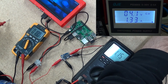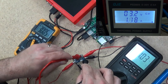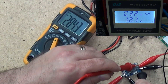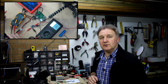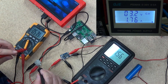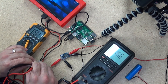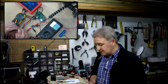I'll drop the voltage to 3.2 volts on the lab supply and have a look at the input. The input is fluctuating a little but we're getting pretty close to the 3 volt mark — around 2.8 to 2.93 volts on the input, and on the output, 5.1 volts. So this one's actually putting out a little bit of headroom at 5.1 volts, which is still within tolerance and fine for most single board computers. The output settles around 5.02 volts accounting for wiring losses.